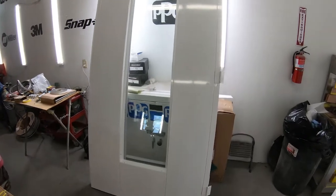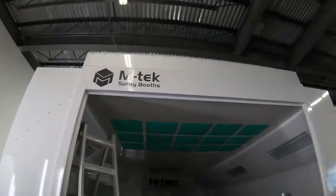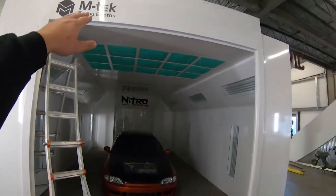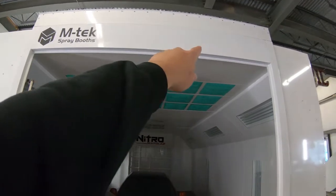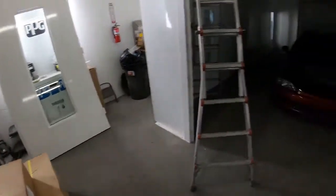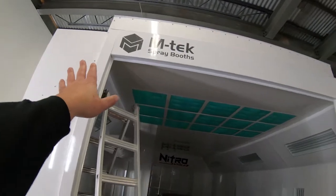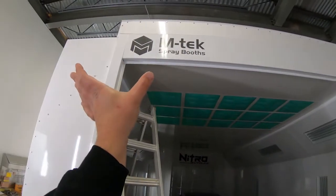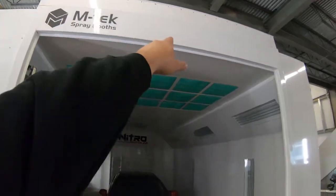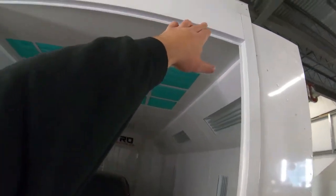Friday before I left the shop I unwrapped the drive-in doors — they are very heavy. As a quick test fit we made sure our door opening was square and even from bottom center to top. One thing we noticed is our header panel has a little bit of a dip in the center. Our concrete isn't exactly the best so there's a slight wave and these big long doors reveal that. We're going to loosen a few bolts in that area and try using a port-a-power with maybe a two-by-four board to shove the header panel up — even three-sixteenths of an inch upward should give enough gap in the center to square up the door opening.